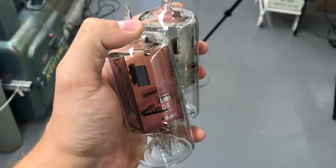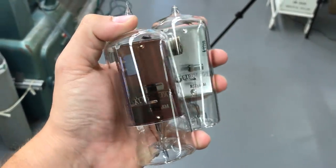The internal system would first oxidize because there is air inside the tube and the oxygen from the air would react with the stainless steel. Some of you suggested using inert gas as a filling before placing it in the oven, but this would not work either — there is still a lot of water and other gases trapped on the internal layer of the glass and on the parts themselves, and when you heat them up they will be released and attack the parts inside. So to prevent this I would need to do a bake-out and annealing simultaneously, which is really really complicated.